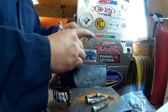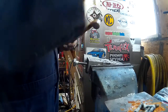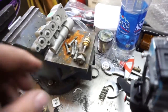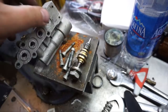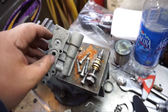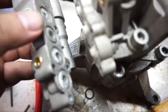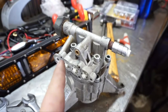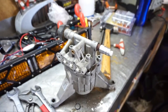This is the pressure relief needle right here — it's actually quite interesting how it works. Inside there there's a check ball. As the water builds up pressure and goes over the pressure relief, it's gonna come through that hole there, and if you line that back up it's gonna discharge right back into the suction and go back around. These are gonna be some valves right here.